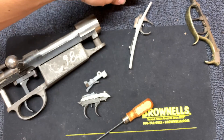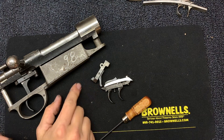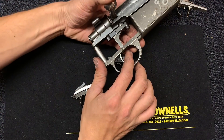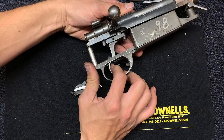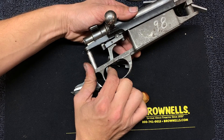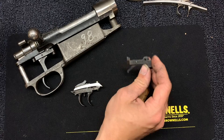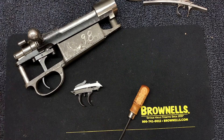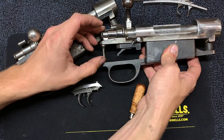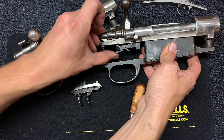These don't just apply to muzzle loaders and percussion flintlocks. Right here I have a Mauser set trigger. Your typical Mauser trigger is a single lever design. You can see this trigger pulls back, cams on the surface, pulls the sear down out of the way, releasing the firing pin. I have another Mauser action here that I'll install it on to show you. When this is in there, your little tripping mechanism hits that and pulls that down — that's what sets it off.